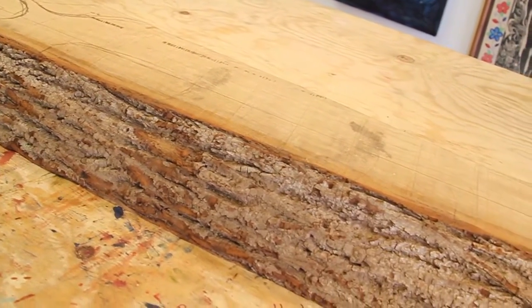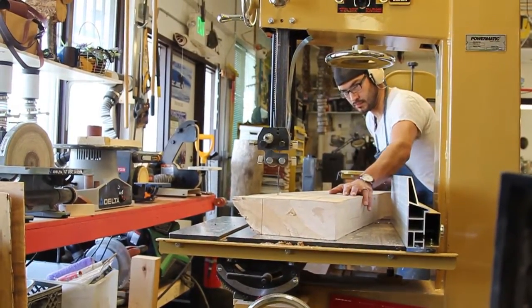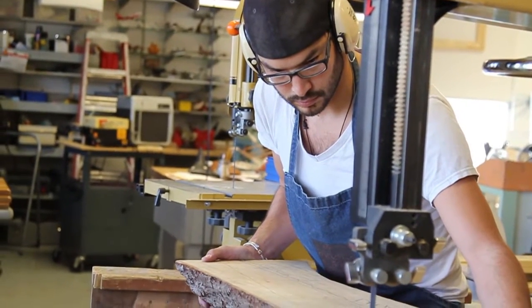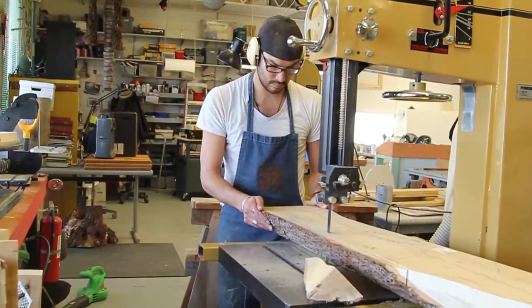It's a soft wood, not natural to Alaska. It's from the northeast quadrant of America. It's a straight grained wood. It's pretty clear, which means it doesn't have a lot of knots in it. And it's not very acidic, so you're not going to have a hard time with your tools breaking down or anything like that. This particular piece came out of Missouri, I think, but I bought it in Albuquerque at an exotic wood shop.